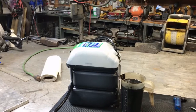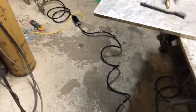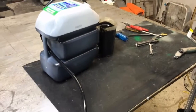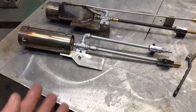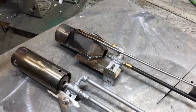So we don't have to rely on the siphon alone. The reason why this is important is because a lot of my customers have found that they come out to fire up a heater in the cold of winter in the morning and the oil just won't pump the same — we need something to beat that. This setup is about $70 worth of equipment to pull that off, though. That's why I don't sell oil pumps with any of my burners — I just go with straight siphon, because based on buying patterns of equipment like this, nobody is really wanting to fork over the extra cash for the pump. It's rare, and it's usually a company owner when they do.